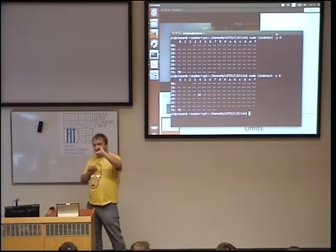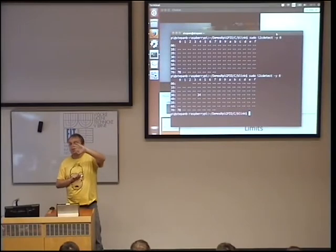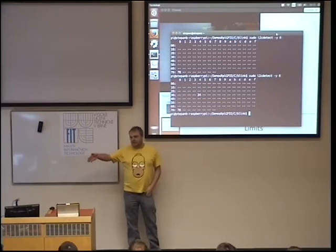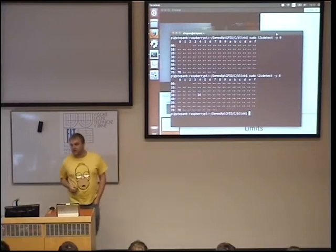And typically, when you are using those EEPROM memories, if you connect some pins of the memory to the high voltage, you can change the address. So typically every I2C device has something like 3 hard-coded addresses, and you can choose one of them. Or, you will see it later, because I use the microcontroller as an I2C slave, and then you program in your application, you say, okay, this will have this address.